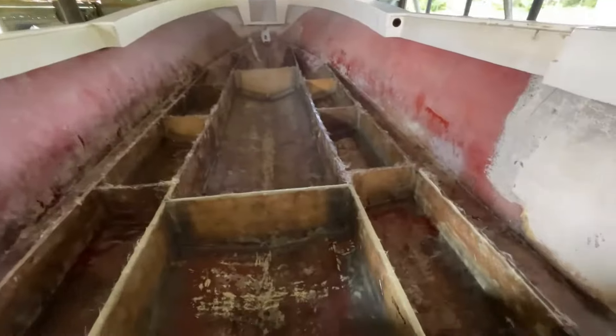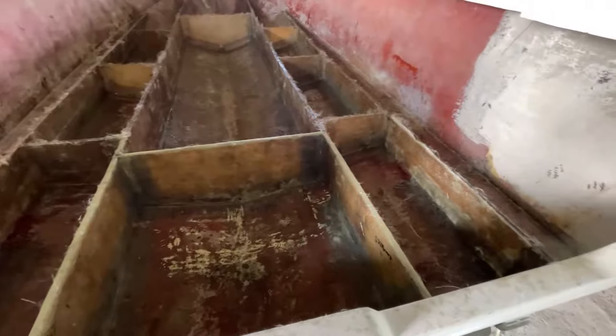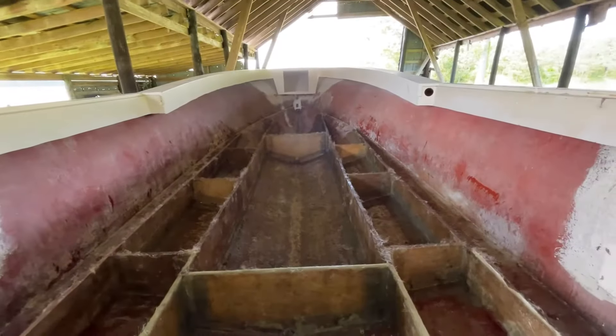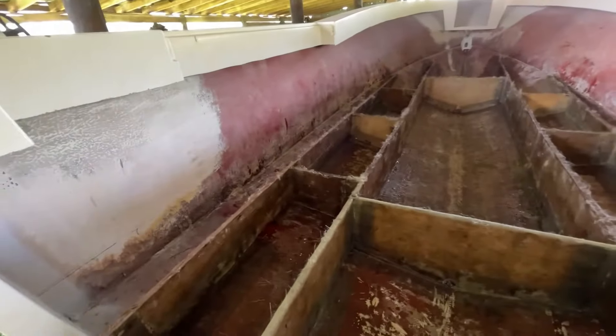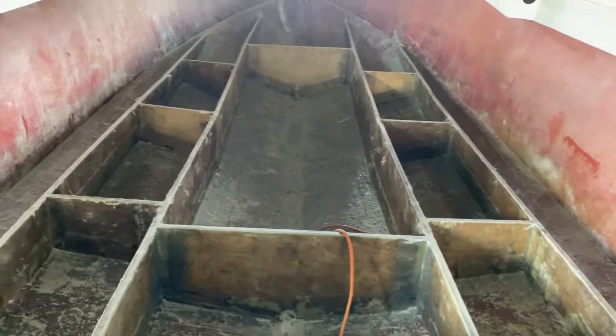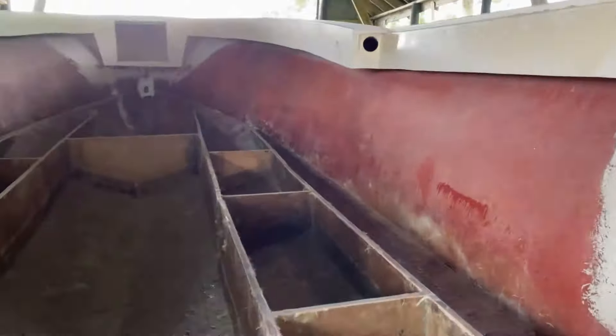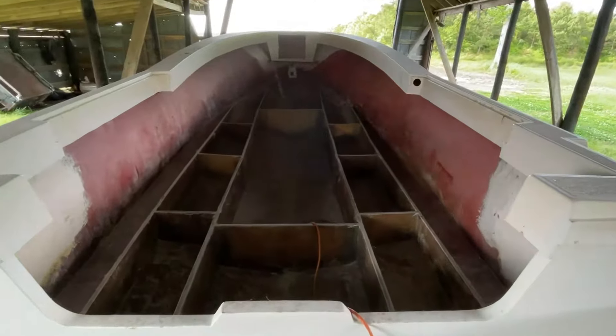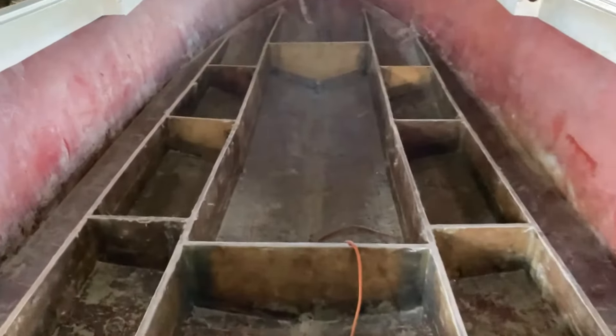The roller actually looks pretty nice. It's a little bit ugly in some areas — like that area right there and basically everywhere else — but it'll get the job done and I think it'll work just fine. Chop strand is all the way down. I just got to do some grinding in the bilge area and for areas that are built up. Looks like everything is just about perfectly level — just need to grind it properly a little bit better.